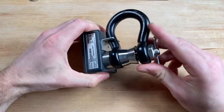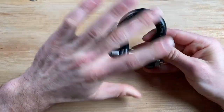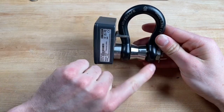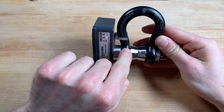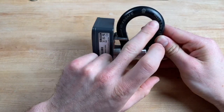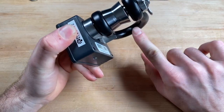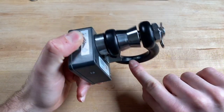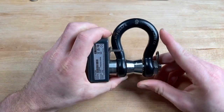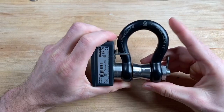While we're looking at the 5/8 cell, a couple of initial things to check. We're looking at the overall general condition. On the shackle bow, we're making sure it's free of any cuts, nicks, cracks, gouges, any excessive wear — wear within this area is pretty typical, but look for excess wear and deformation. Check if we're bent outward, inward, anything like that.